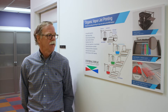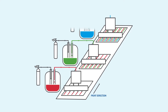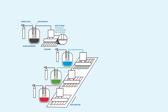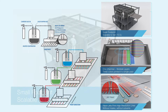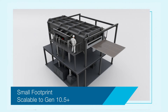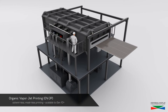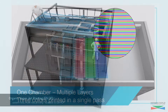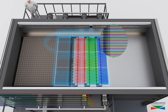The poster illustrates schematically how this would work. Red, green, and blue materials are printed sequentially on the moving substrate in one process chamber. The photos on the right depict an artist's conception of how a commercial production scale system might look. The top photo is an overview of a production system and includes a mannequin to show the scale. The modular nature of the direct jet process allows for scalability to Gen 10 and larger glass size. The middle photo shows the jetting process, where red, green, and blue lines are printed simultaneously on the substrate.